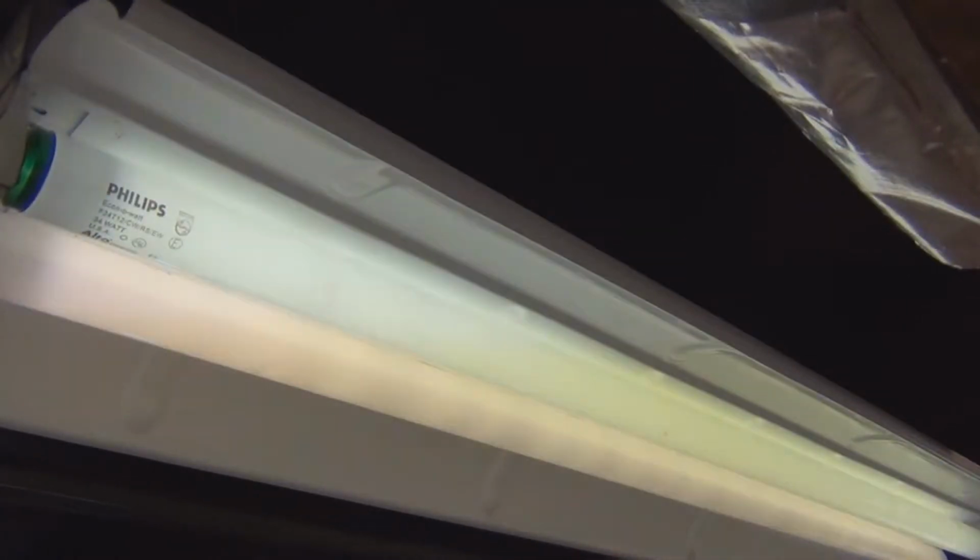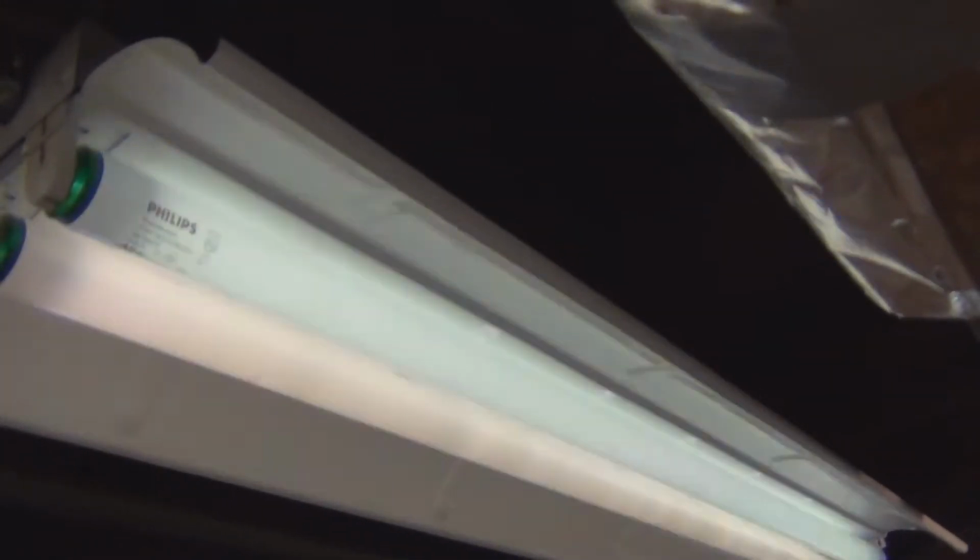I changed the bulbs, and that had no effect. I bought a new 10-pack maybe of fluorescent lights and tried the newer ones. So I don't know, maybe I just have to cherry pick. Maybe the ballast has aged, even though it was never used. But yeah, it's about 58 degrees in the cellar, and this eventually will warm up.